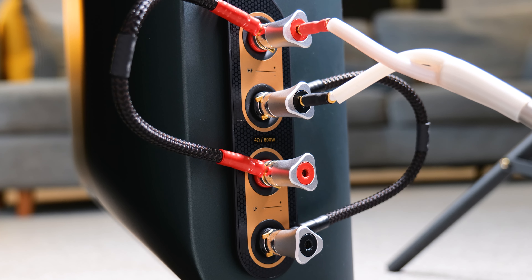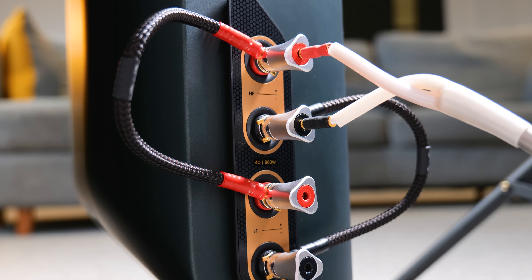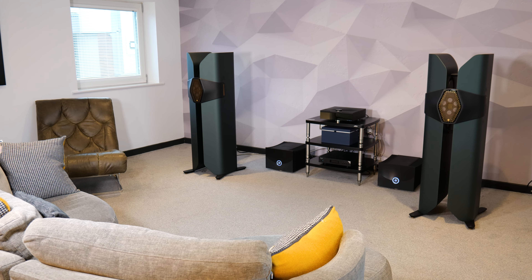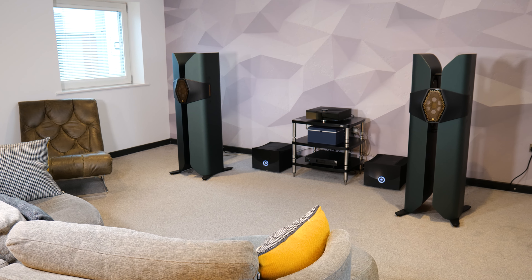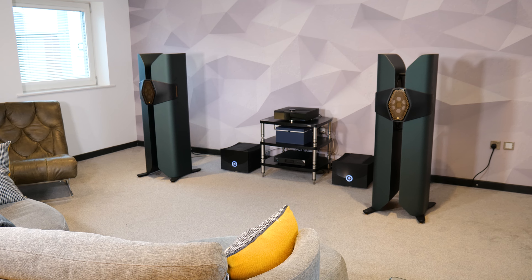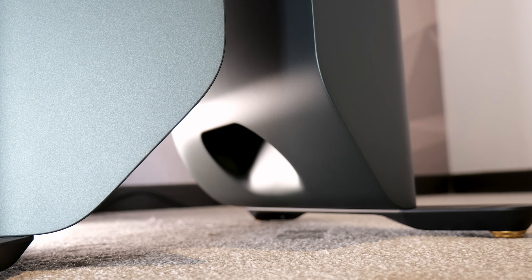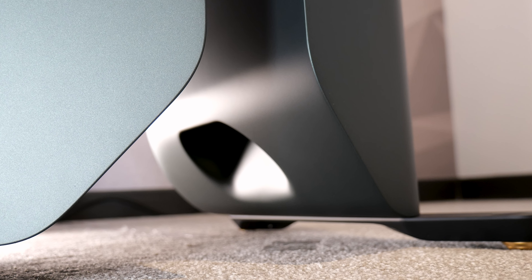Even the crossover is made from custom bespoke components and sits on a vibration-isolated assembly. In-room frequency response of below 15Hz and 18Hz at minus 6dB, all the way up to 60kHz, well beyond the limits of human hearing. It's designed to sound like a sealed cabinet, so it's nice and tight and punchy, all the way down to around 35Hz. Then there is a bass port which is tuned to around 25Hz, which just reinforces the very lowest octave of the bass register.